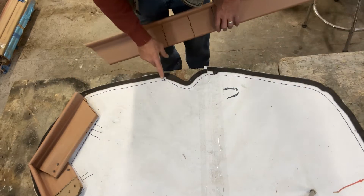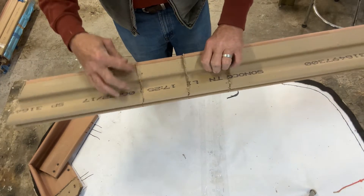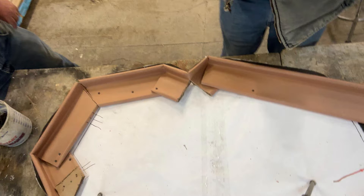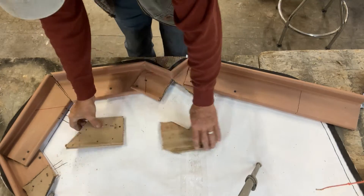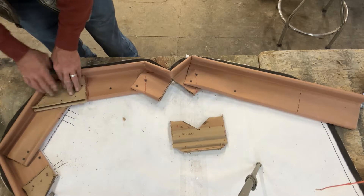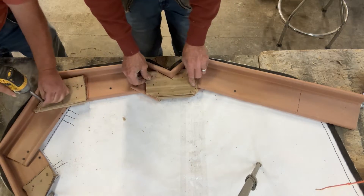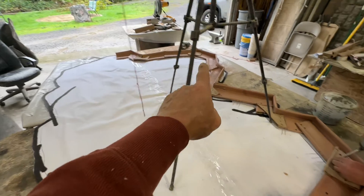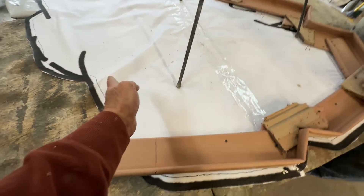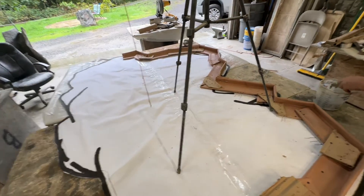This is a straight piece, but obviously the rock outline is not a straight line. What I've done is marked every corner and cut these on the saw so they fit the curve — and you can see they're all flippity-floppity now. To seam two different plates together and unify them, I've cut an extra plate piece. Jim's going to set some screws in that, then we'll turn it over and screw it up from the bottom, cutting off the extra screws. That's how we've made all these seams and joints consistently — they're stronger than before we cut them. Now we've got our plate and can start with the studs to make the actual vertical walls of this rock.